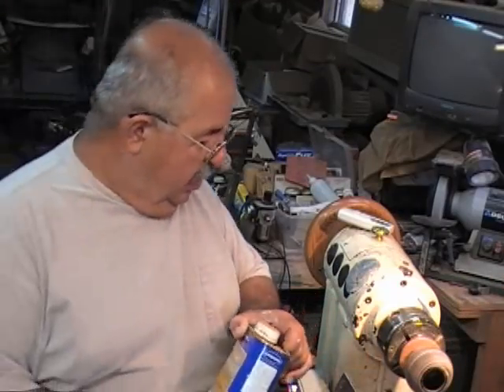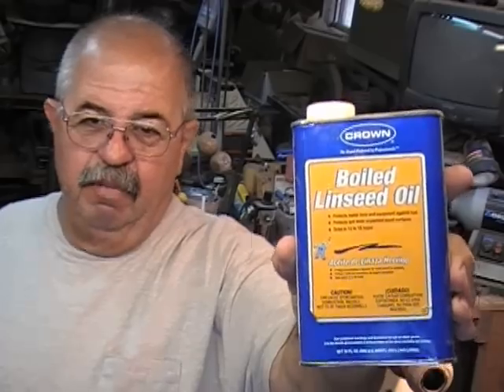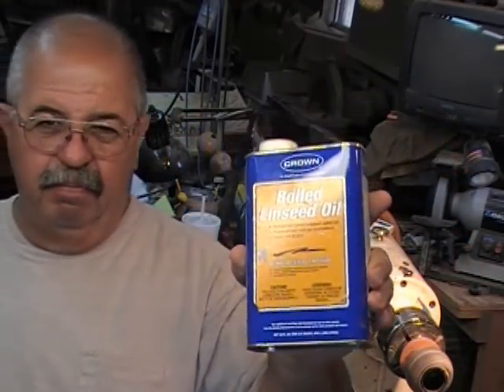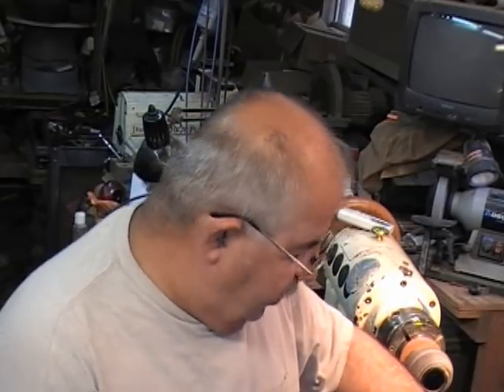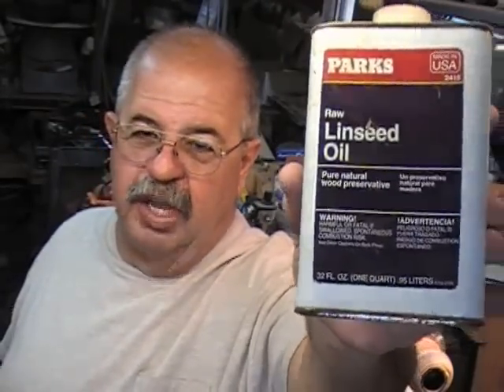Let's talk about the formula. We're going to start with boiled linseed oil — BLO. Before you go out in the shop and find in the garden section where you put your hoe handles and outdoor wood handle tools, and you find raw linseed oil — you don't use this. And don't ever, ever, ever try to make your own boiled linseed oil. There's no way to do it in a crock pot, double boiler, or microwave oven. No way to safely do it at home. There's a whole lot of people in the burn ward that will back that up.